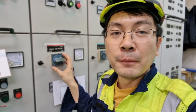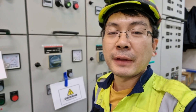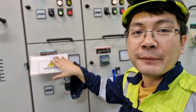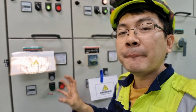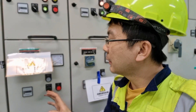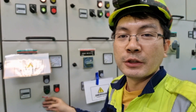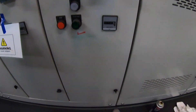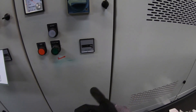The engine room fan number two is already not working — the motor is defective — so with the previous electrician we already did the requisition. This is number five now. I did the isolation before touching anything. Make sure that you isolate the system and do the lockout tagout and make a permit to work, so that we can assure the safety of every crew working on this unit. Proper PPE must be observed before doing this kind of job.